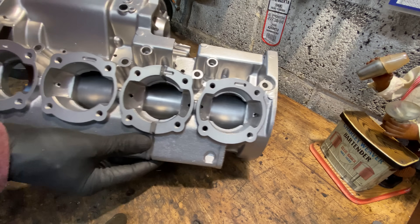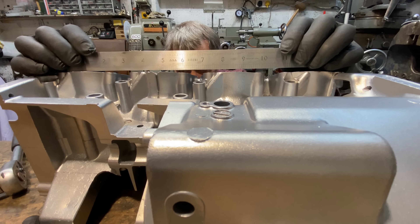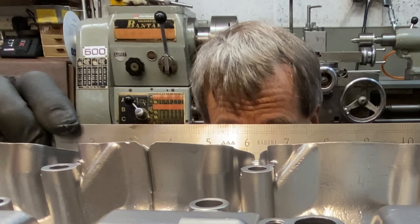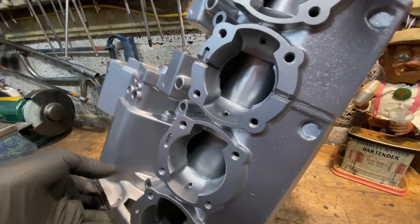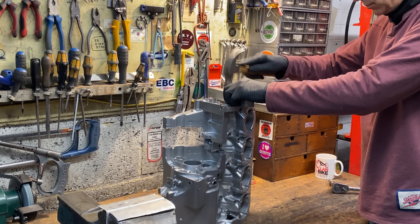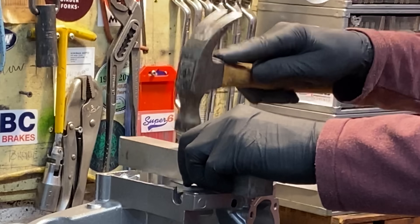With the nuts tight I turn the crankcases back over to check that the barrel mounting points are all in line. I use a steel rule and I'm looking for light through the gap — and these are just perfect, so I'm really pleased about that. I tip the crankcases up on their end and tap them down to make sure the gap is closed right up. We don't want any gaps — if you've got gaps this can cause distortion in the welding process.